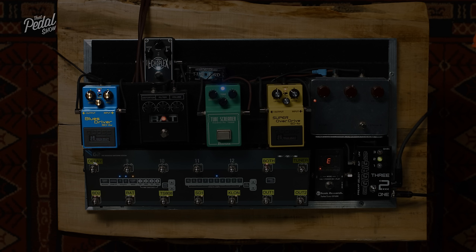Then a bit of amplification that's done with an operational amplifier, an IC. All transistors, but an increase in amplitude in some manner. Then once you've increased that, something to clip it and make it distorted. And then EQ, shaping that from there. And then the output section. And in terms of the amplification, the clipping bit and the EQ, as Dan said, they don't necessarily have to be in that order.